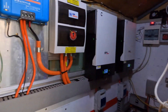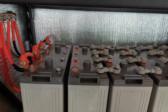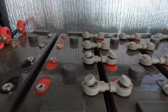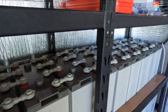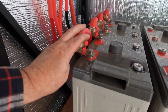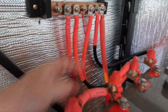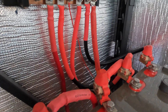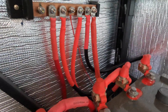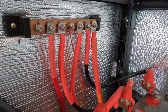What we're doing now is removing all the links because these batteries are all in series up there and all the way back. Then I'll take the fuses off and take everything off the bus bars. After that, there's going to be a plug in the lining so the new batteries will just plug in like any generator or electrical appliance.